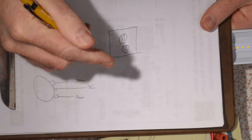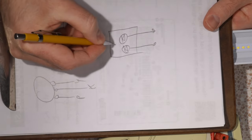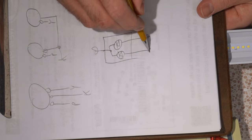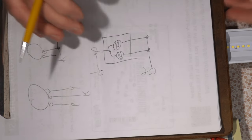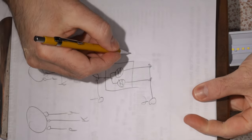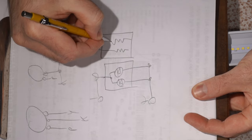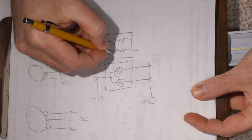It's going to be an impedance difference between the two elements, right? So internally, you've got two LEDs. They have what appears to be a common ground. So what happens when you connect them together is one of them has a lower impedance than the other. So you've got to imagine a circumstance where, say they were resistors, even though they're not, but they do have a respective voltage drop. The red one would maybe be, we'll just pull a couple figures out of our arses here.